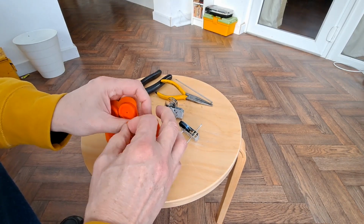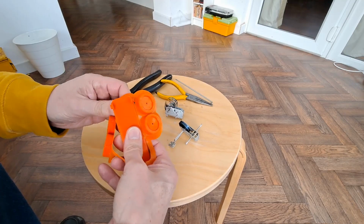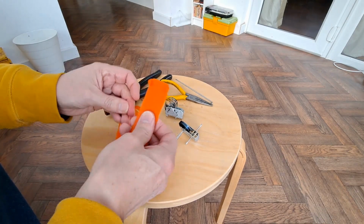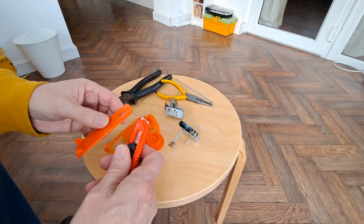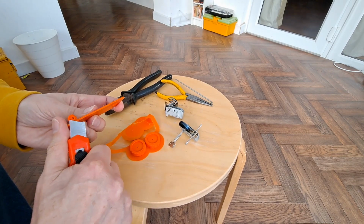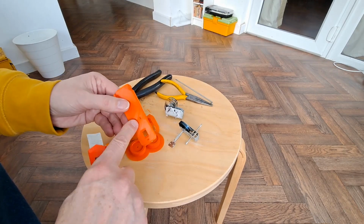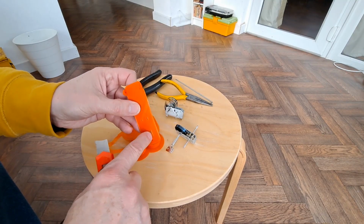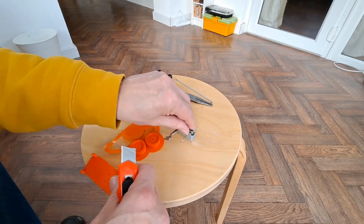This is just the very basic, just so we can see whether the wind-up motor can actually pull any weight or push any weight, whichever way you want to look at it. So the wheels are just some random wheels from one of my other models. And this chassis or tray, I just measured the dimensions of those pegs. Made slots for them, a bit of a gap there because that gear there just sticks out below the bottom of the tray.